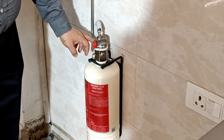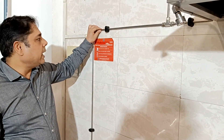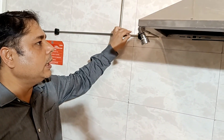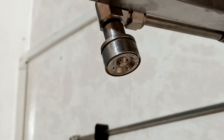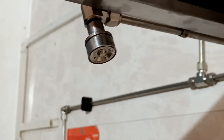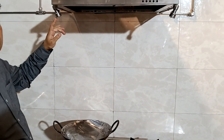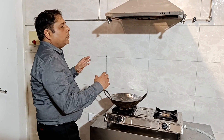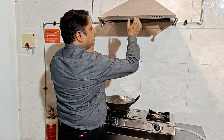This allows the agent to go through a separate supply line, which is a steel 10 by 8 mm line, which takes the agent — water in this case — up to the nozzle. The nozzle spray pattern covers the whole top of your cooking range. The minimum distance required from the nozzle to the oil surface is 600 mm and the maximum is about 1350 mm. For a 3-nozzle system, you can go up to a 900 mm hood size with nozzles at both ends and one at the center.